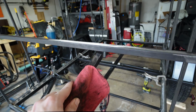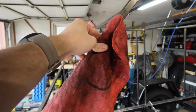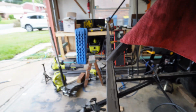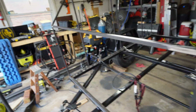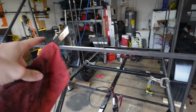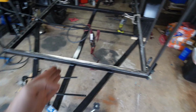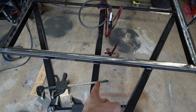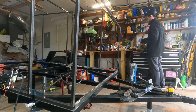Top to bottom here to there is 31.5 inches. This angled piece here with our new crossbar here is 21 inches right here, and probably 20 and 15/16, but I'm just going to shave it down with a 45-degree angle because those are easiest to cut. We're going to get all these put on, and then we're going to work on our horizontals for the doors and windows. Our first vertical slash first angled are going to be 14 inches off of each side, and then the middle one is going to be, obviously, dead center. But 14 inches, 14 inches, and then it comes out to 14 something.